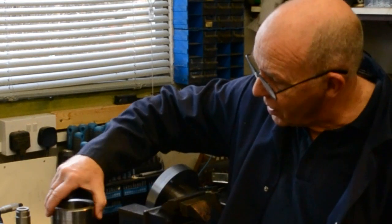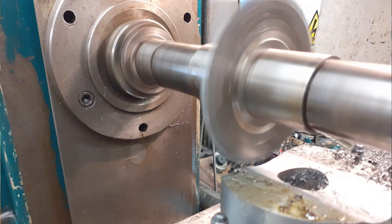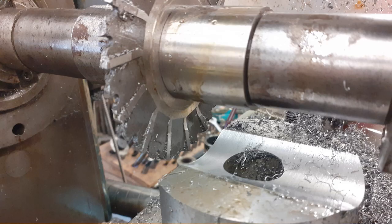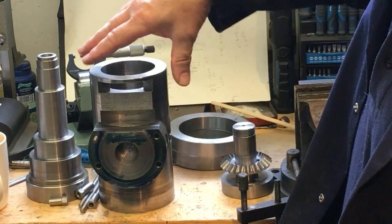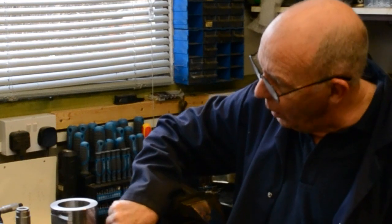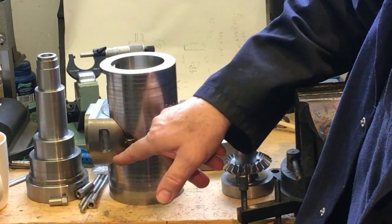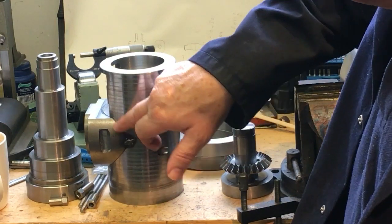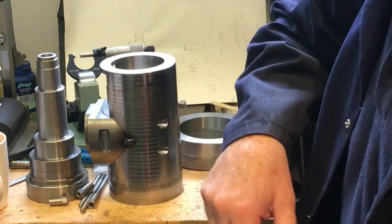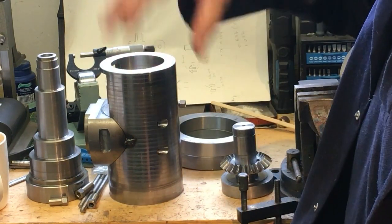One of the disadvantages currently is that I've had to cut this using a 4 inch side and face cutter, but I had to do it by hand because I had to take it across on the axis. So that's where I am at the present time — I've just tack welded this in place so that I can do a little bit of grinding to give me some weld prep, weld this up, and then do a little bit of final boring to take the bearings.